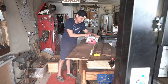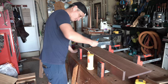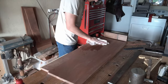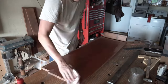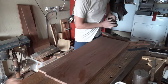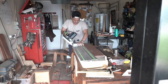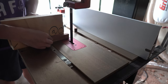The tabletop required a small glue-up. I've done this technique in a couple of videos where you fold the pieces like a book on each other and then gang joint them together — you end up with two congruent surfaces that seam together nicely. I didn't use any alignment aids like dominoes or biscuits here and the seam came out exceptional — absolutely unnoticeable. While I paired a nice board for a grain match, what I didn't notice was that after wetting the board, which mimics adding a drying oil finish later, there was a fair bit of color variation between the two pieces. When I dropped it off with the client, he loved the way it ended up looking, so that worked out quite nicely.